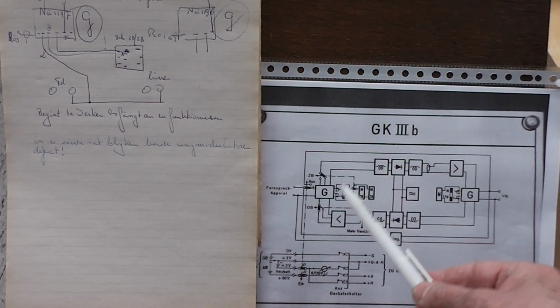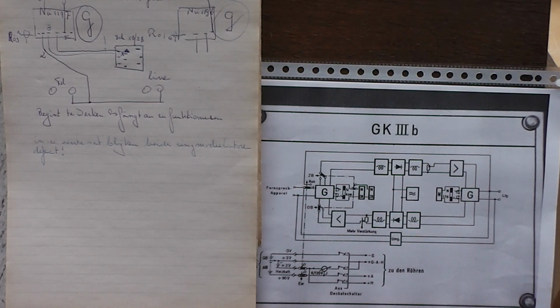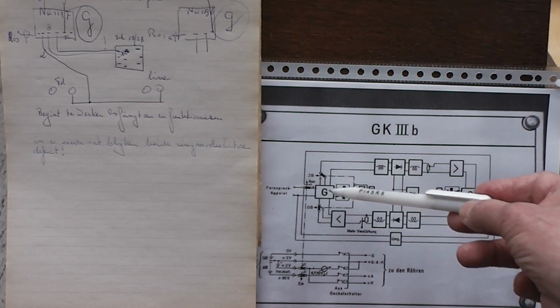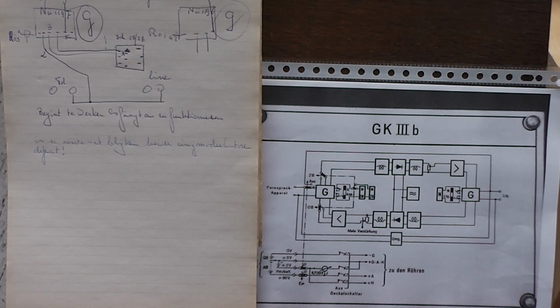doing its work this way, lower sideband transmitting into the line, Leitung, and arriving on the Leitung via this bridge fork system, as we call it. In England or in America they call it hybrid system. The incoming signal is being converted, scrambled, but when the signal coming from that way is also scrambled, then you scramble twice. That means reversing a sideband twice, and you get the original position of the sideband. The problems which we were facing at the beginning is here.